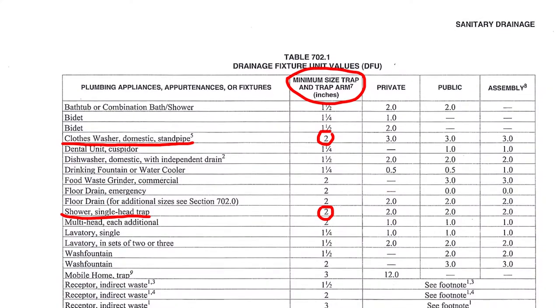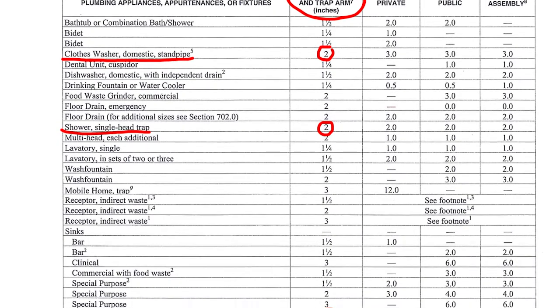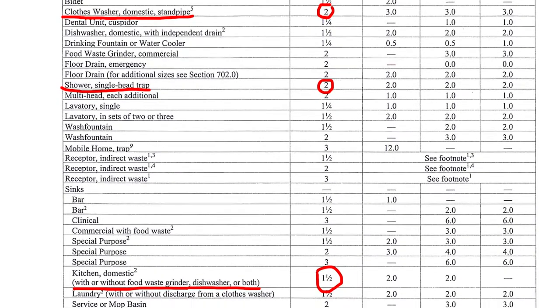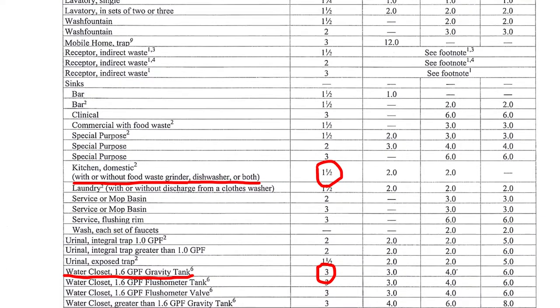The kitchen sink trap is under the kitchen sink, just like the lavatory trap, so it's also not shown here. There wasn't a good place for a kitchen sink vent because all the interior walls are on the other side of the tiny house, so instead I used a larger pipe size — this is called a combination waste and vent system. Toilets require a three-inch pipe and a two-inch vent. The laundry and shower require a two-inch trap and a one-and-a-half-inch vent. Both sinks require only a one-and-a-half-inch trap and vent.